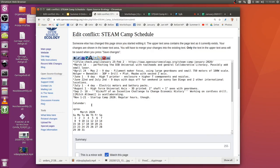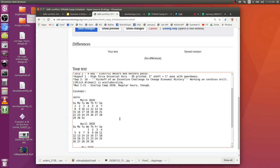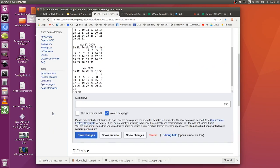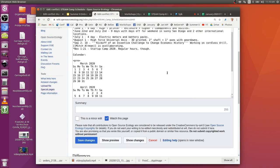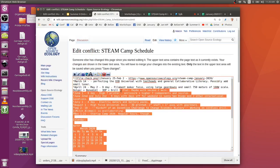That should work based on the tests done. The etchant used was 16% hydrochloric acid, which isn't enough - it's too slow. The solution used by the other team was two parts hydrogen peroxide to one part muriatic acid.